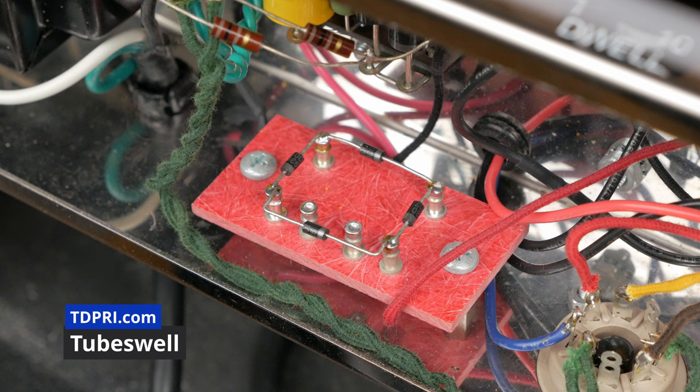In the end, I landed on an Accutronics and Belton 4AB 3C 1C long decay vertical wall mount tank without a bag. This was a very challenging and rewarding build. By trying to reduce the noise floor of the unit, I was forced to learn a ton about rectification, grounding, and even a little bit about impedance. If you're down for an educational experience, this could be a fun project for you.